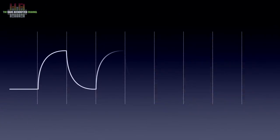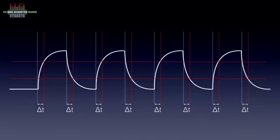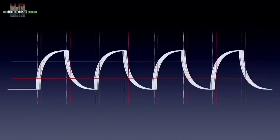Up till now we have seen perfect square waves, but these never happen, for it would require unlimited bandwidth. They will at least have rounded corners, but to explain the problem I've drawn what can happen in a very exaggerated way. I have drawn two horizontal lines that indicate the threshold for the electronics to decide if there is a polarity change — the upper for up-going voltage and the lower for down-going voltage. The vertical dotted lines show that the moment in time the voltage change is detected has moved to the right, thus later in time. This is no problem if it is as constant as shown here. The problem gets more serious when we combine the distorted waveform with phase noise — now the detection of the voltage change can be at the moment of the first dotted red line or just as well at the second red line, and the difference between them again shows the jitter.